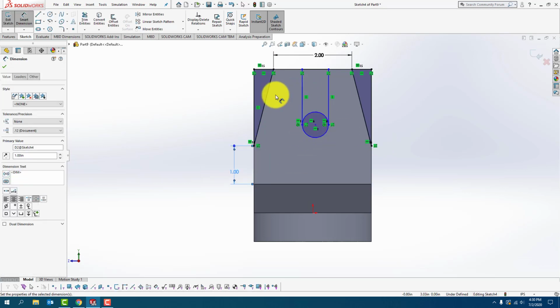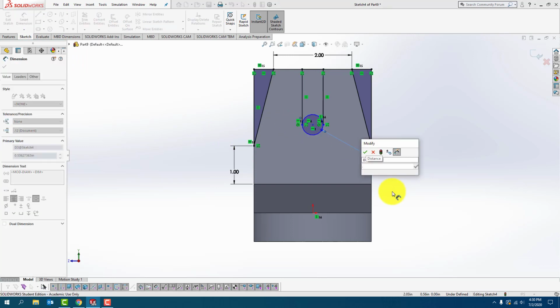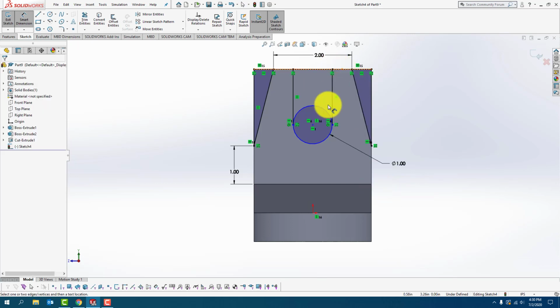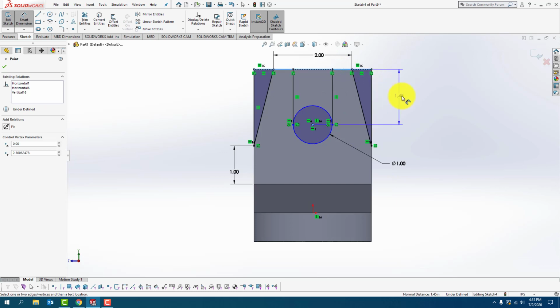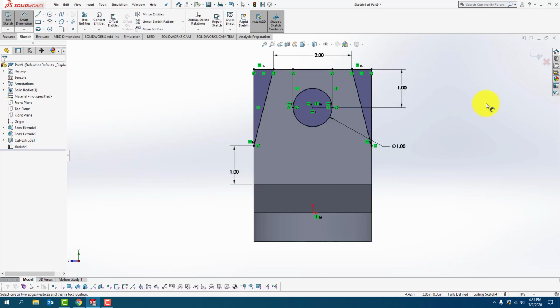And there it is. And that's because of right angle trigonometry. As long as I know what the legs are, I know what all the angles are. It makes it really easy. Here the radius is 1/2 inch. So it must be a 1 inch diameter. And from here to here, it has to be 1 inch. And there it is. Done.